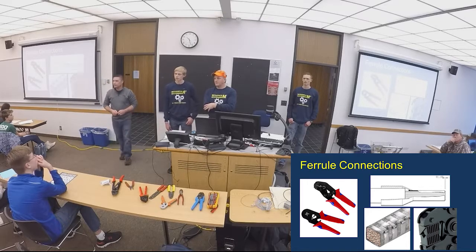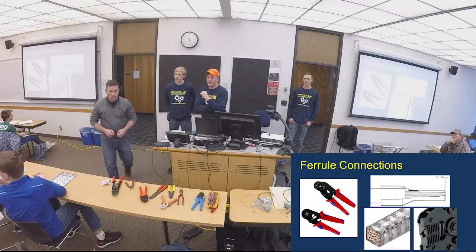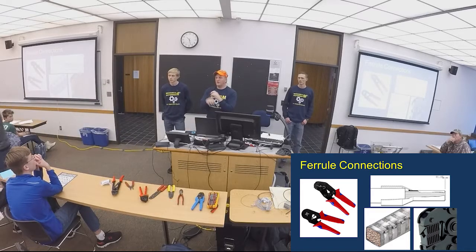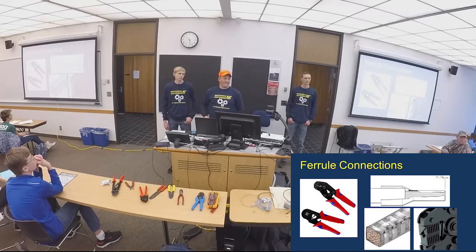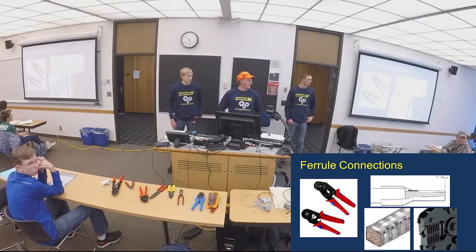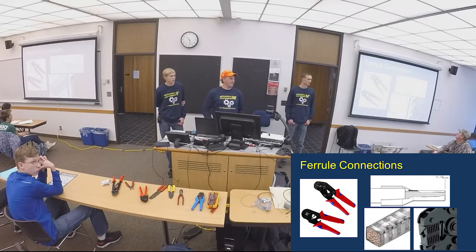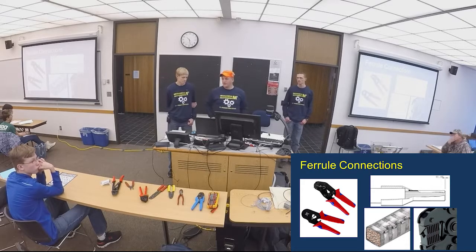You had mentioned there's square terminals. That's what the crimper does. You prefer them over the round? Yes, because these fit these terminal blocks. You can just punch them in. So you push it in, you'll just pop it in there, and then you take the thing and put it back. We bought some rails last year, we didn't fit and all that stuff. Right. Not to mention the contact surface area, the round surface against the flat blade. Yep. There's hardly anything there, so you want to punch it. Yep. So our recommendation is to buy the square one.